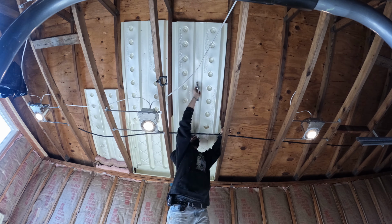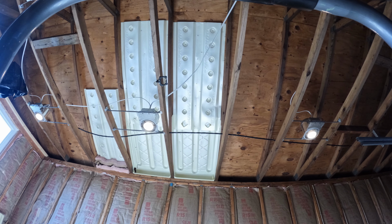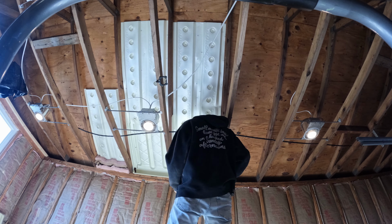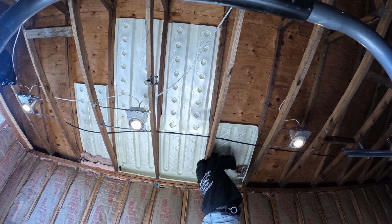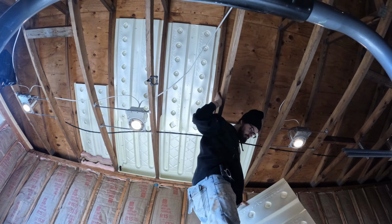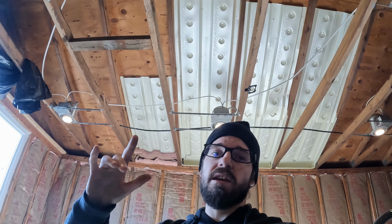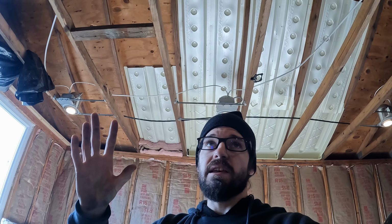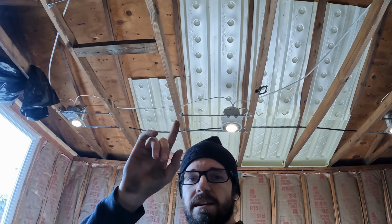So if you're doing the one with the integrated baffle, install it like I showed you here today, and then extend it by laying those flaps that we fold around over the bottom one that you install. If you go with the other option, where you have to use insulation and provide your own baffle, then you will continue to extend them up just by lining up the rivets. Alright, this is done for this video. So if you want to see a time lapse of the whole ceiling along with the gable vent installation, everything else we do to prep for the blow-in installation, check out the ceiling insulation video. Otherwise, this is the end of the Durovent comparison video and installation.